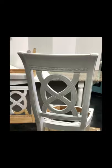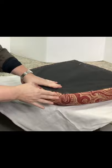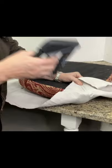This is a drop cloth — a heavy drop cloth that painters use. What we're going to do is put it in four places. If you notice there are some notches here. Where I normally see things go wrong for people doing upholstery work are these front corners. First thing you want to do is pull up here and put in the first staple using this little hand staple gun. Come right in here — there's wood right on the front.